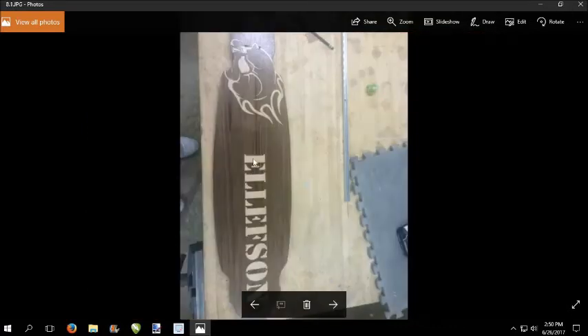Here is the board he made — this is the bottom side at least. His last name is Ellison, just like me. This shows a couple of different things. First, image placement: he cut off the interesting part, the teeth, the very intricate parts — he put it too close to the end. Make sure when you're placing images they're not so big that they extend off the end, but also that they're in a place that's actually going to be seen. He should have backed this up a little bit.